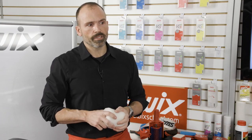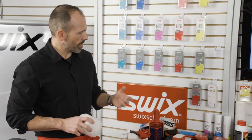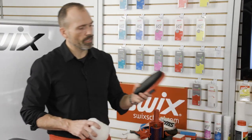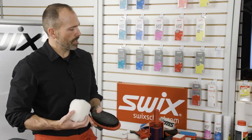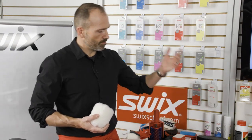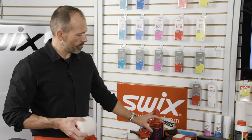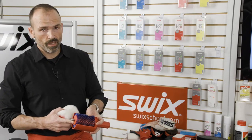What progression of roto brushes would I use instead of hand brushes? The roto brush comes in a steel barrel, so you can get it in steel, and then I would use probably a natural fiber like boar's hair, and then finish with a blue nylon. That's a really nice finishing brush.